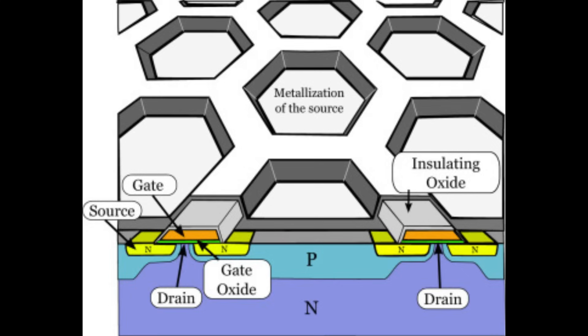You could probably make one in a waffle pattern, but the waffles would be rectangular. Silicon is a cubic crystal and likes to break along straight lines, so a waffle pattern might add too much stress, causing breakage. The hexagonal pattern is a little more robust and allows you to separate things nicely.